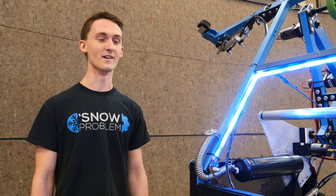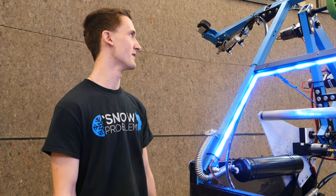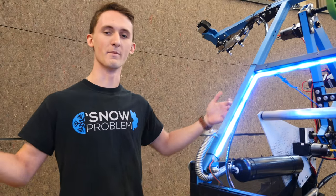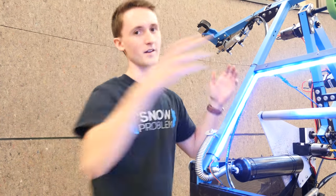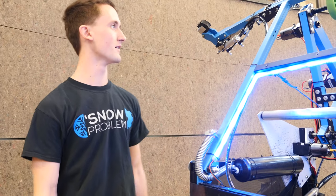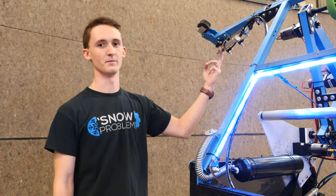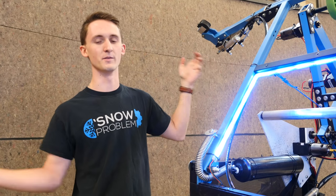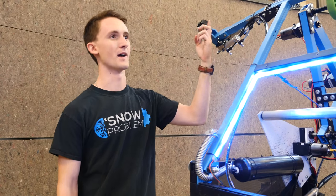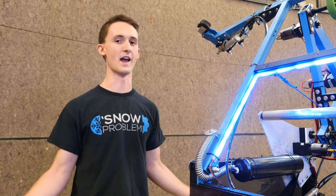Back here we have the hug and tug mechanism to climb to the level three hab. We do this by clamping onto the box. We have a spring-loaded mechanism that extends to four feet. On one side we have two cylinders on a linkage that provides a four-to-one increase in force, so we get about 200 pounds of clamping. We have rubber pads on each side, which provides a really secure grip on the hab platform.